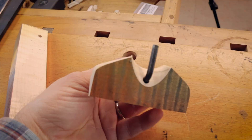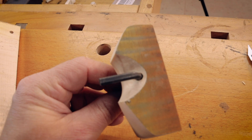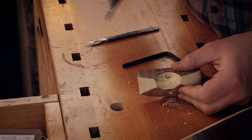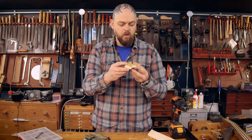The allen key is sticking out the bottom too far because the hole is a little bit too narrow. That's not an issue — I'm going to go in with a step drill. Step drills rule, if you haven't had the pleasure. That will do nicely. So I need a tapped hole from the back of what's going to be a blade, to just lock it in place against the front.